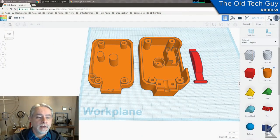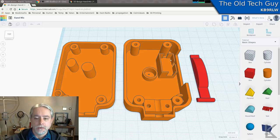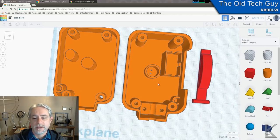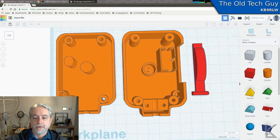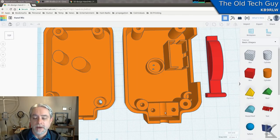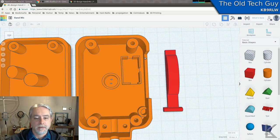So I knocked up this design for the microphone — let me show it to you. In here we've got a pocket that holds a micro switch, a pocket for the little electret condenser mic included with the kit. You can see two little holes here that go through to the front to let audio in. There's strain relief down here for the microphone cable, a pocket for the pin of the push-to-talk lever, and the paddle at the top of the push-to-talk lever comes up and blocks against the case. Everything test fits just perfectly.